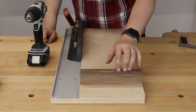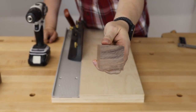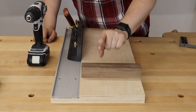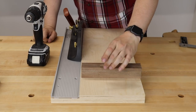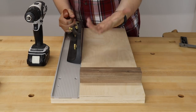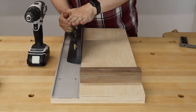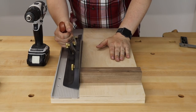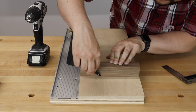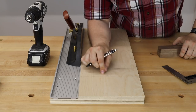I have a beautiful piece of quarter-sawn walnut here. As you can tell by the grain direction, it's quarter-sawn, and I want the grain running parallel to the board so it will expand and contract mostly in the vertical. I want to put this in the board to be able to shoot pieces that are maybe four, five, or six inches wide. I want enough room that the plane is supported all the way through the cut — that's five inches. I draw a very light pencil line and write 'top' so when I put this back together I know which direction this piece should be going.